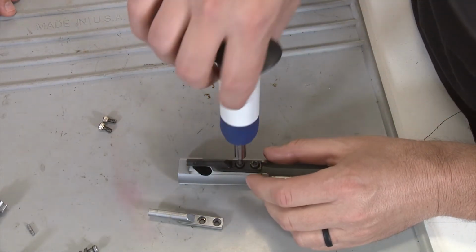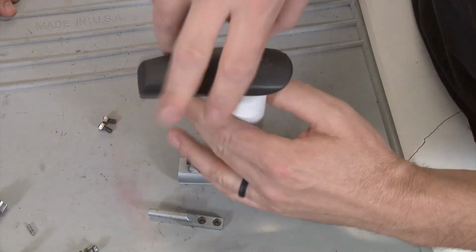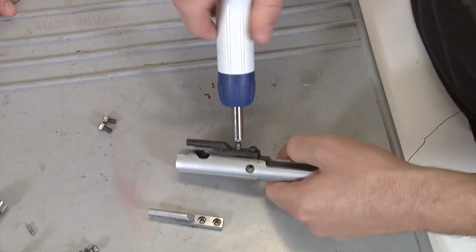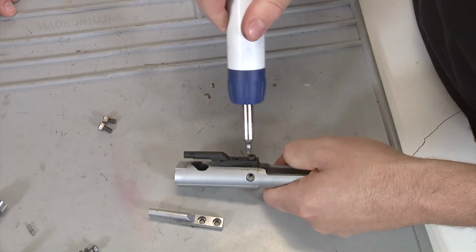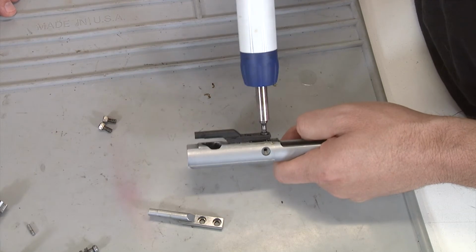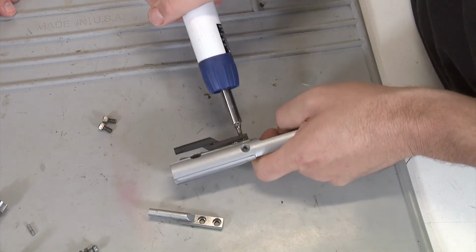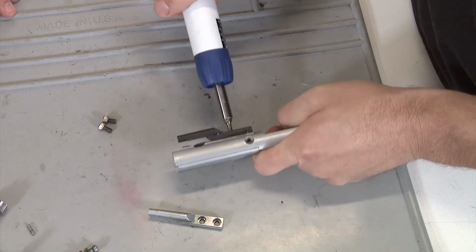So from here, we're going to tighten our screws down to 55 inch-pounds. And torque, first one. What a difference! Those things are torquing to spec. The other ones, yours, we didn't get anywhere close. Yeah, they were yielding big time.